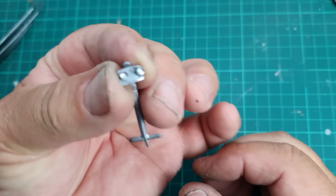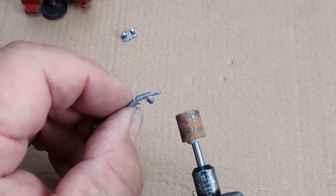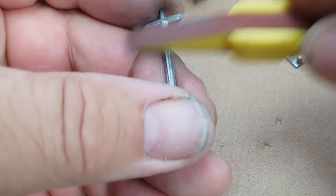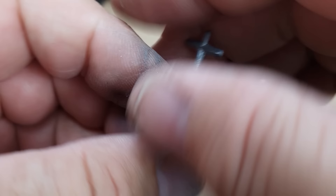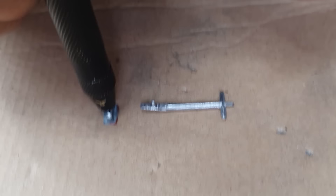Now I have to attach the plate to the new drawbar, which means drilling a hole to accommodate this pin. The pin is a little bit too large, and if I drill a hole to accommodate it, it would weaken that little plate too much - so I'm going to grind the pin down so it's thinner, meaning I don't have to drill such a large hole. This model is going to take a lot longer than I thought - it's a very complicated model and I must admit I didn't quite know what I was letting myself in for.